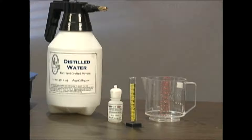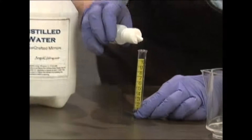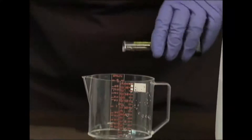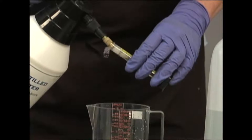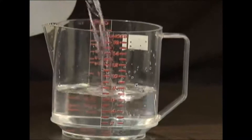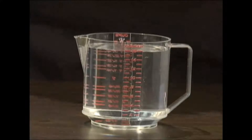Gold, copper, and galena mirrors are sensitized with tin for gold. Note that this is not the same as tin for silver. Measure 3 ml of concentrated tin for gold into the 10 ml cylinder and pour it into the 16-ounce mixing cup. Fill the cup with distilled water to the 16-ounce mark. You will have more tin than you need, but you will have the right ratio of tin to water.